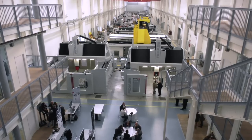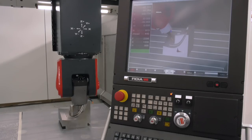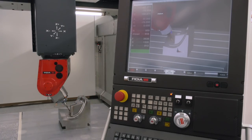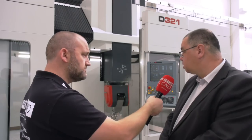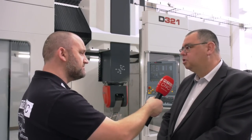I know we've talked about rigidity, but let's go into some details about the rigidity build of this machine. The construction is all done here at Fidia — they manufacture all the parts themselves. For instance, on the Z-axis, we have a twin ball screw drive system to compensate for any straightness or misalignment. All the castings and fabrications are oversized, as we mentioned with the size of the RAM. They do offer a very, very rigid machine.